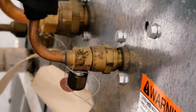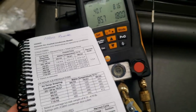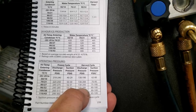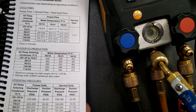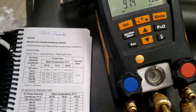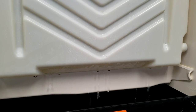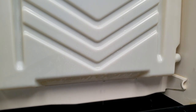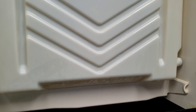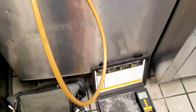I'm not a fan of those quick connects at all. We're in harvest right now — about a minute and 20 seconds in. For around 80 degrees your harvest pressures should be about 135 to 200 for your head, and 75 to 100 for your suction. So I went ahead and added about two and a half pounds to it — it's about seven pounds total charge. There she comes. There's a drop — that ain't good. Yeah, it's got some issues but we added two and a half pounds to it.